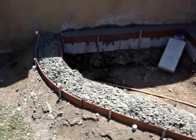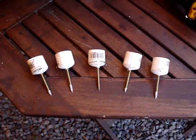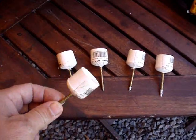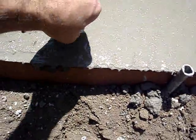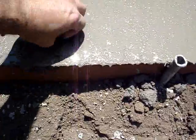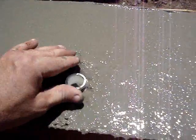I just fill in all the concrete blocks and level it out with the top of the forms. I have these PVC caps that I put screws in, and these are going to be later for my little fence — to keep kids from being able to fall into the pond. I just take these and put them into the concrete and they will be nice and secure when it dries. These are half inch PVC.